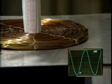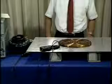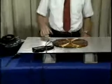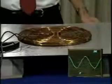With a 1 millimeter thick plane, the coil does not lift up even at 30 amperes RMS. The ground plane is now so thin that most of the magnetic field penetrates through it. We just blew a fuse — this time because of an arc. The enamel insulation on the wires may not be enough to prevent arcing to the sheet. Let's try it again with some gaffer's tape for better insulation on the bottom.